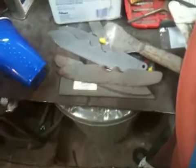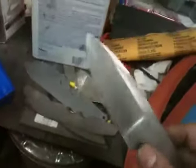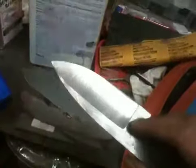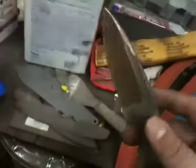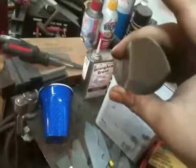For the second one I figured I'd do something a little bit differently than I've been doing recently, which is flat grinding my blades. Typically I'd be putting flat grinds or full flat grinds on these blades, but I wanted to try a hollow grind on this one. So I got my 8-inch contact wheel out and tried to brush up on my hollow grinding again. It's definitely been a while, so it's a little bit of a learning curve for me, but I'm fairly pleased with the results.